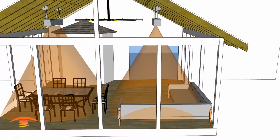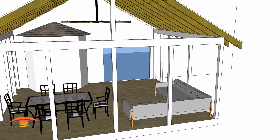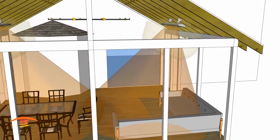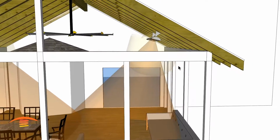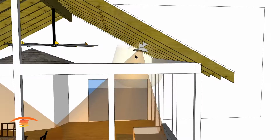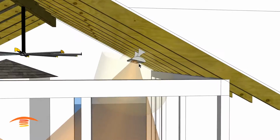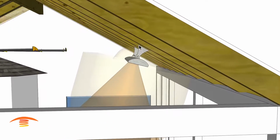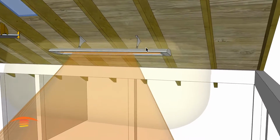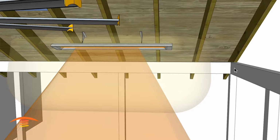So let me go ahead and take that off and give you a different option. Different option would be using an all electric heater. Now what I've done with this, these are Infratech C series, the CD for dual element, 6,000 watt. And what I've done here is I've lined up the brackets. Now I have both heaters placed at roughly 4 feet off the center.